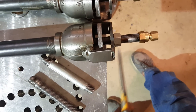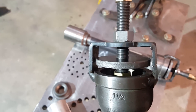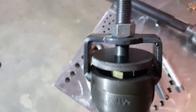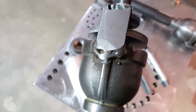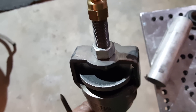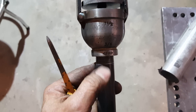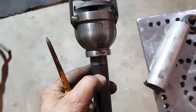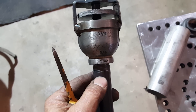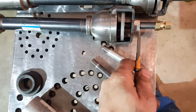There's a lock nut, and then this piece here is a bracket I cut out on my CNC table — a piece of 3/16-inch steel that starts out flat. I cut relief lines in it as guides so I know where to bend it. After it gets welded onto the reducer, the whole thing gets chucked up in the lathe so that part lines up perfectly with the pipe nipple. You want that aligned as precisely as possible down the bore for efficiency and flame quality.